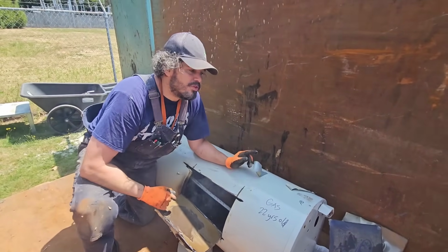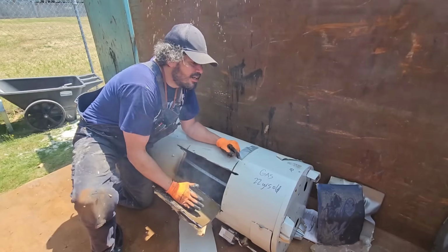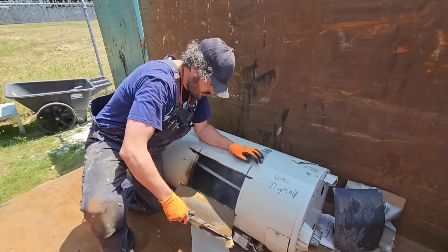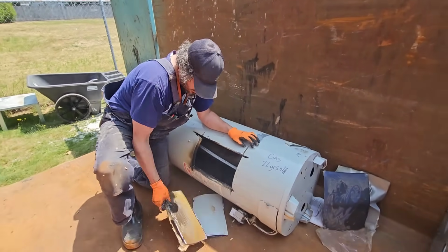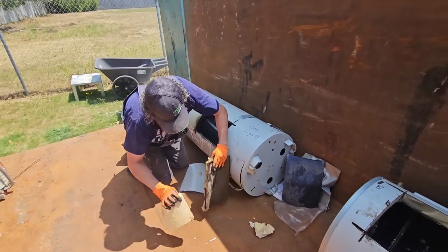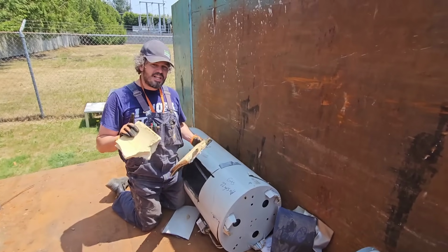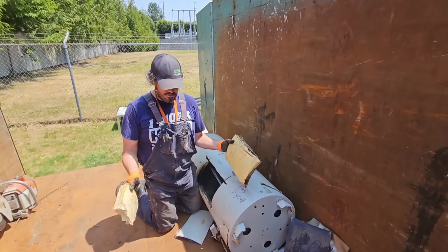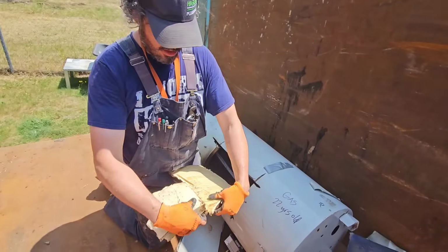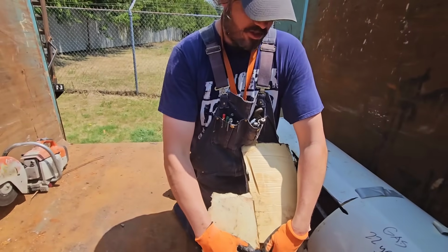So this one, that was 12 years old. This is 22, so this is 10 years older than that one. So it's not purple, but it's definitely some kind of glass lining. Now that's something, and this is why today's hot water tanks are just slightly larger in diameter. So you guys, when you install these really tight, I mean, who knows, 10 years from now, you may add a little bit more insulation to them, making them thicker. But look, the 12-year-old tank compared to the 22-year-old tank, they started putting a little bit more insulation on them.